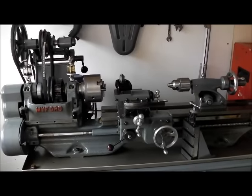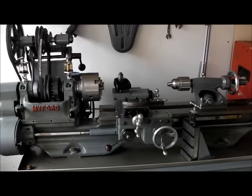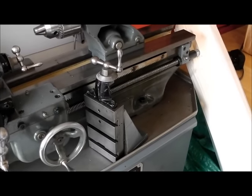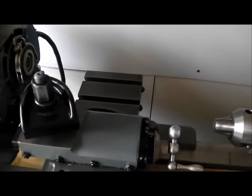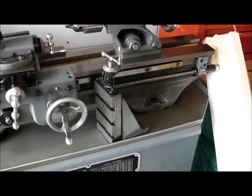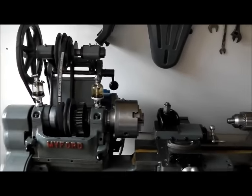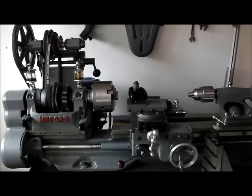On this project there should be lots of bits of film at the lathe making bits and pieces — I'll try and make it as interesting as I can. I've recently got a Myford vertical milling slide which fits on the T-slots and bolts in place of the top slide. That should greatly increase the capability of the machine. I need to get a collet chuck to go on the spindle and some collets to hold the end mills, but it's something I'm looking forward to having a go at.